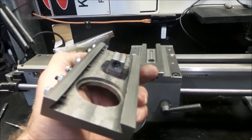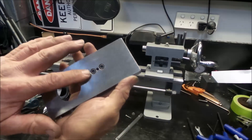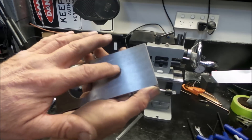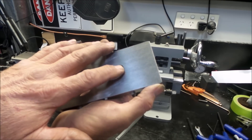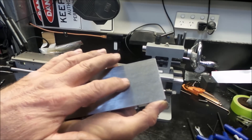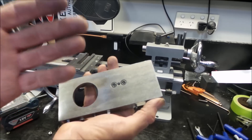I've had the cross slide assembled and it seems to function quite well. One thing I noticed: I cleaned up the bottom of the bolt holes because the countersink area had actually been drilled with a normal twist drill, so the shoulder the bolt head sits on was on an angle. I went in with an end mill and created a flat shoulder at the right height — just another typical quality issue. Recess done with a twist drill — that's just poor practice.